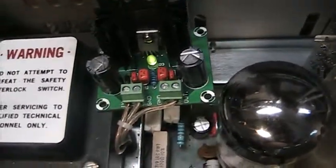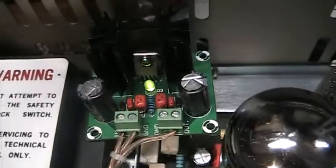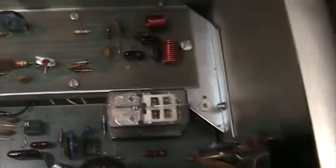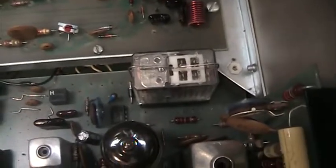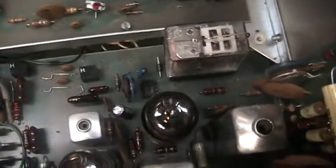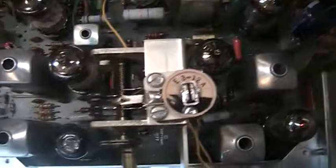And also, instead of a tube powering the relay with high voltage, that now powers the relay. The relay has been replaced with a low-voltage 24-volt relay instead of the normal 115-volt relay powered by the tube. These are a lot more common and a lot easier to get than the hard-to-find high-voltage type.